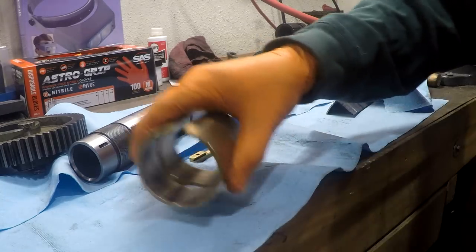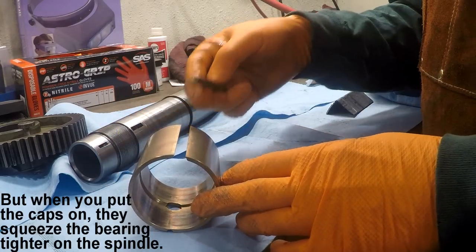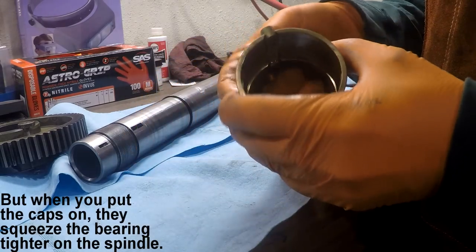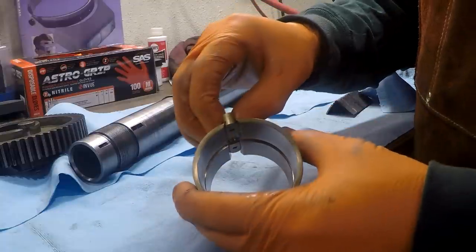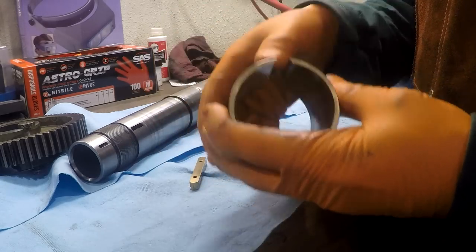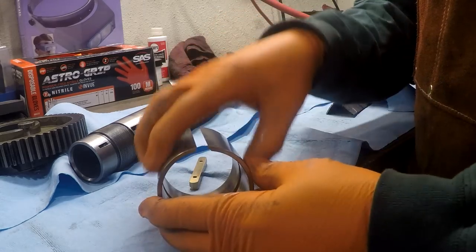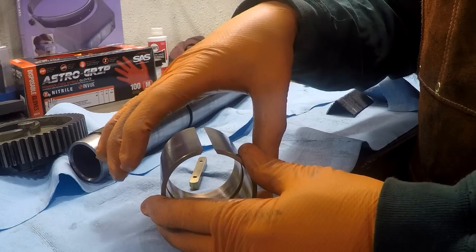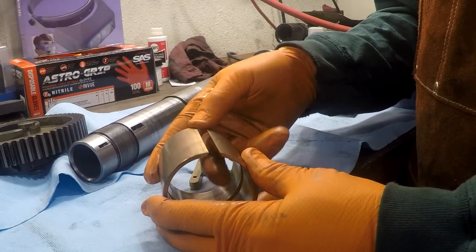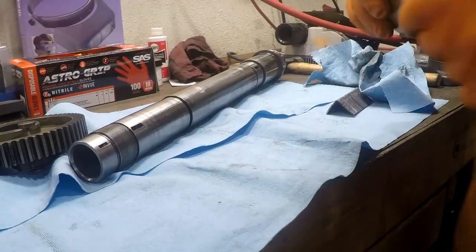When you put the bearing on, it's going to be a kind of loose fit on the shaft, but what this bearing expander does is it pulls up and expands the bearing. It pushes it out against the shell, the bearing cap and the casting below, and that assures that the bearing is all the way out, so it's against something rigid. It also assures that you have a little bit of space in here for an oil film, and it's a consistent thing.